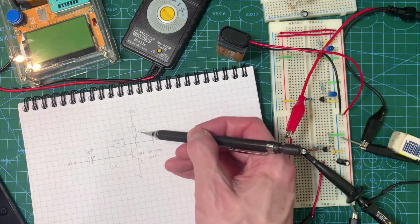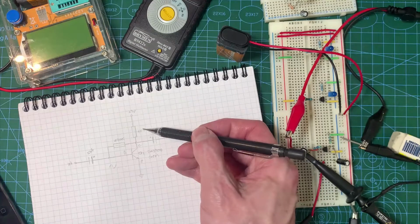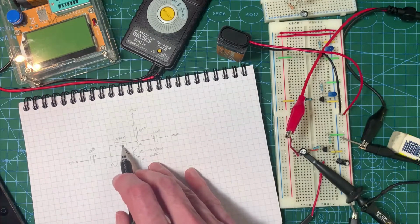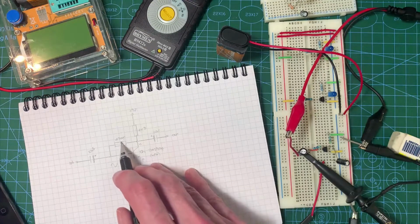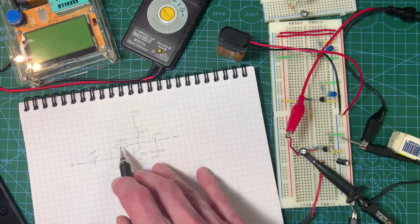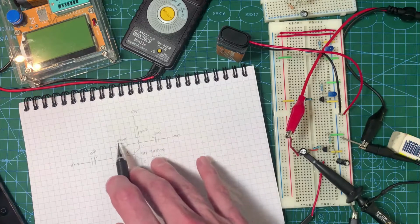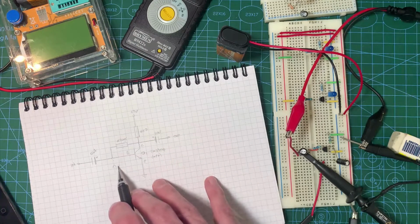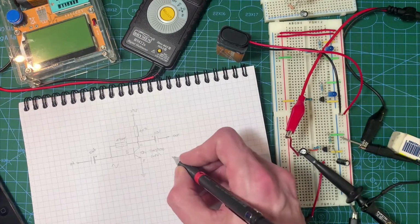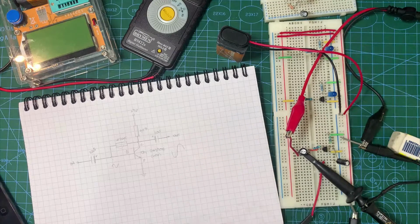The transistor is being protected and biased by this 4K7 resistor. And then you'll see there's a feedback network, just like we had on our op amp, with this 470K, or 470,000 ohm resistor, feeding back some of that collector output back into the base. This causes the transistor to further amplify the signals. It also helps stabilize it. So out of here, we have a much bigger signal.